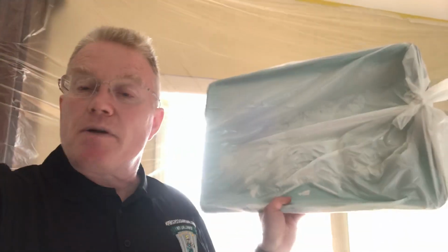You still get the traction because the roller will rub up against these traction marks in the roller pan, but it won't take any of the residue of the old paint that may get into, by chipping off, the ceiling paint that we're rolling on. So we put a plastic bag around it, but if you're going to do this, tie the bag, because after rolling a few times, you'll see that the bag comes loose, and then you get the paint going into the roller pan, which defeats the whole purpose of using it. So there you have it.